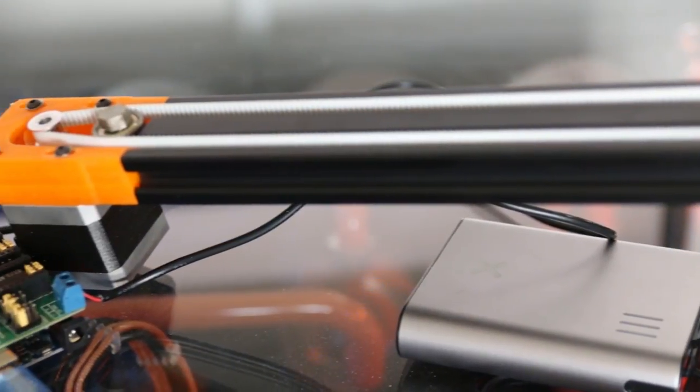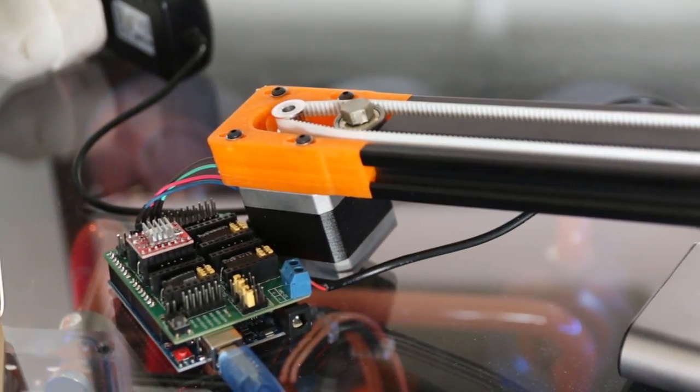So I thought of another solution. I still had the GRBL shield from my first CNC experiments, along with some Pololu drivers. This gave me the idea that just for testing purposes I could use the GRBL shield and driver with Universal G-code Sender to tell the slider how to move. Because I already knew how to use GRBL, everything worked pretty much right away — I had the slider tethered to my computer, put a camera on it, and it actually worked and looked decent.